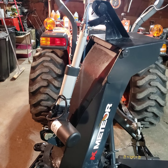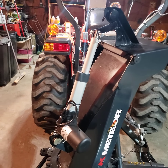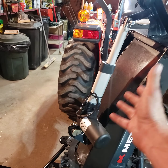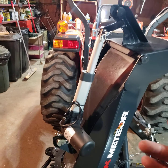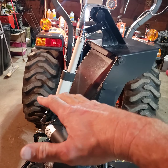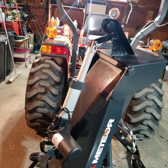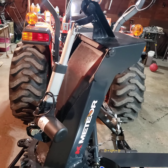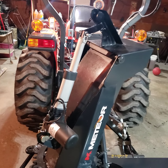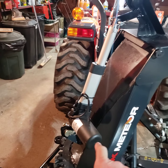Actuators, the way they work, you can get them up to like 20,000 pounds of force, but it is going to move 1/8 of an inch a second or whatever. It's just a threaded rod with the motor and tighter the threads and all that. So you look at the speed, so there's a give and a take. The faster it goes, the less weight it can move. So I'm sure you've seen YouTube videos with guys that have one on and it takes them forever to adjust. Well, that's because it's way overrated for the weight on what they're doing. So this wasn't, I don't care.